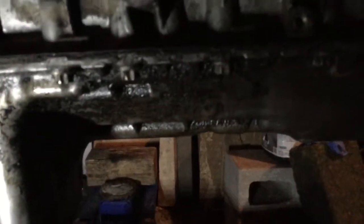Now it's time to remove the oil pan. We're going to do it with the engine standing still, straight up, because there's some oil that stays here for a long time. Even though we dropped the oil, there's still some left in there. So if we rotate the engine, it's going to make a mess. To prevent that, I'm going to remove all of these aluminum bolts. You can see there's one, two, three — there's several.